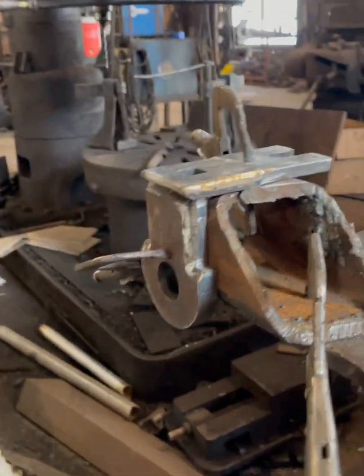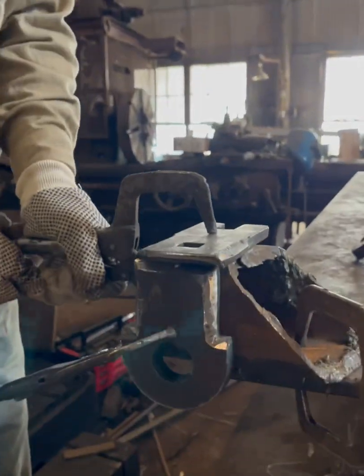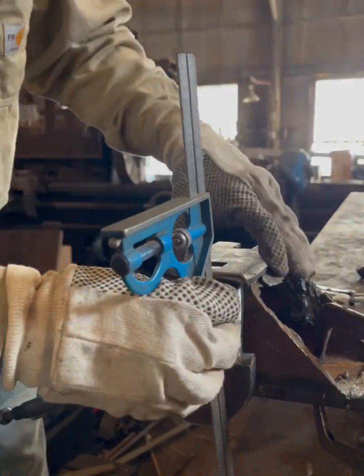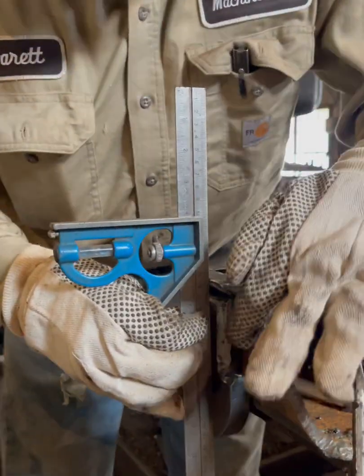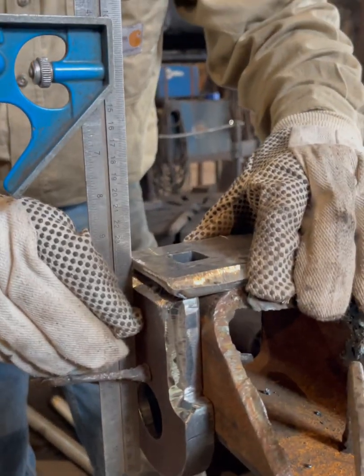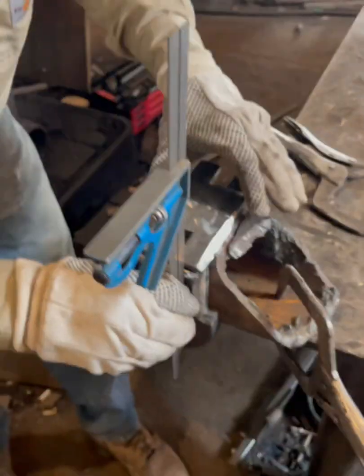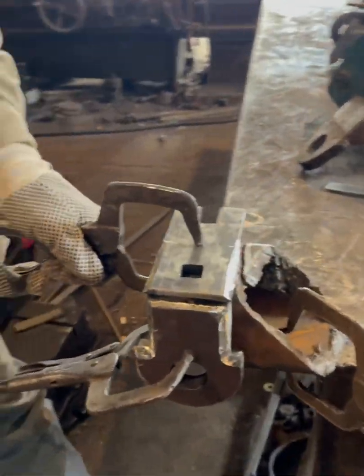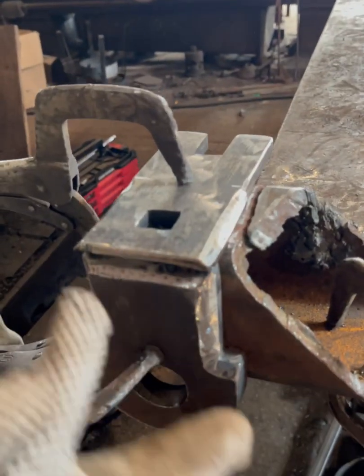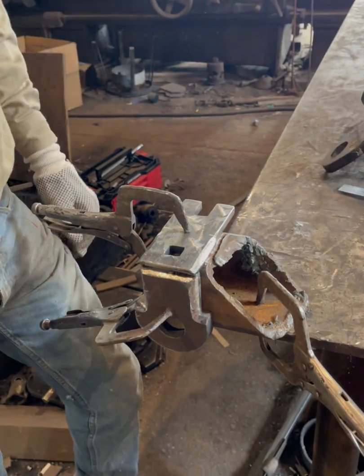I'm gonna clamp it. So right there, this is set where we want it. Now we need to do that to this one. The way I'm gonna go about that is I'm gonna use my straight edge. I'm gonna line up this with this. You can use it here like that and get them in line. And then on the front, we want it flush with the front of that plate we just squared. Right about there. Right there. Now if you're perfectly flush here and here, that's gonna put you square this way. As long as you have a square cut, which we do, so we're good.